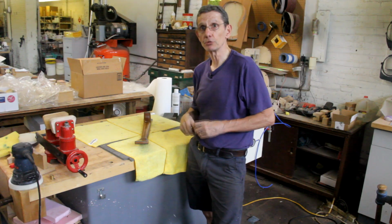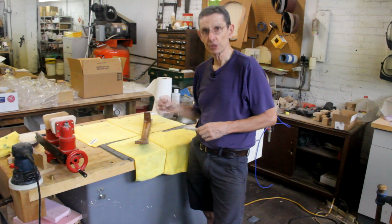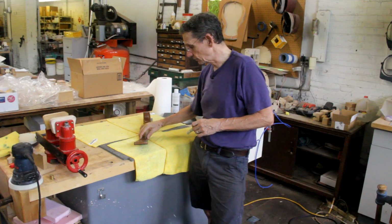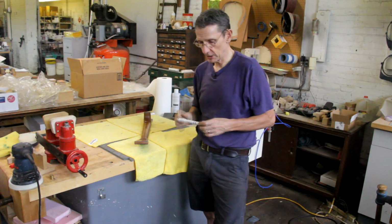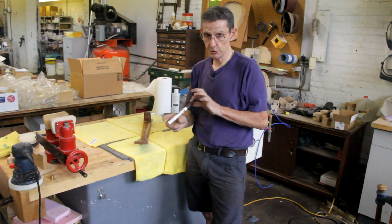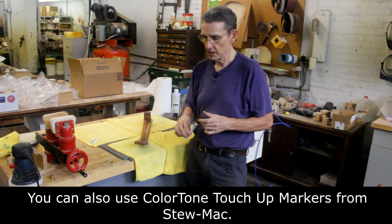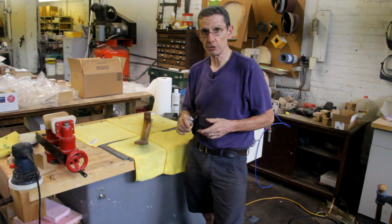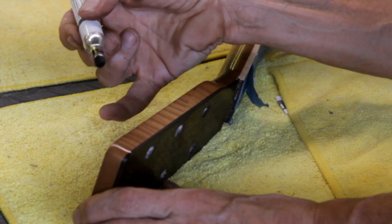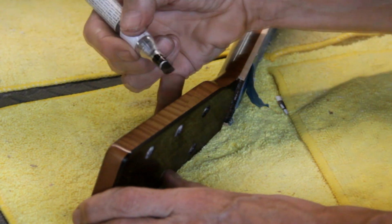Now, just like I showed you with the troubleshooting in the gloss top coat section, you could take a brush, shellac, and some of those colors that we used and put a little bit of color on that little edge. But that's a very, very small edge, and it's hard to control your color with that. So what I do is I just use a furniture touch-up pen. You can find these just about anywhere. If you can't find one, you could probably just use a brown Sharpie. These markers are nice because they have a fine chiseled edge, which makes application of the color very precise and easy.